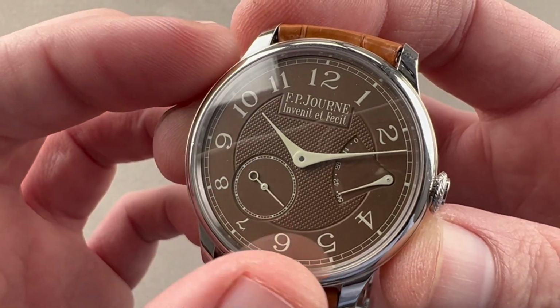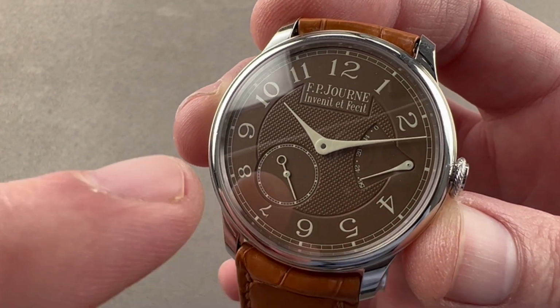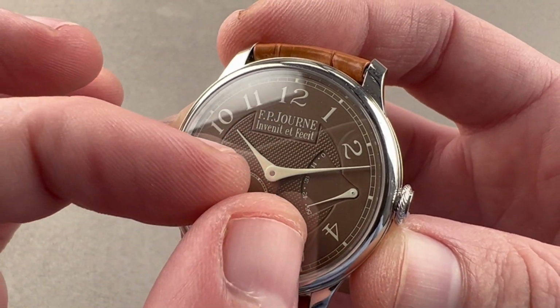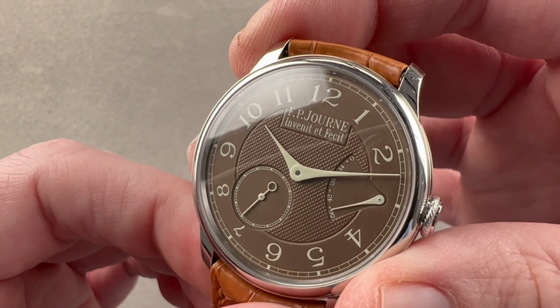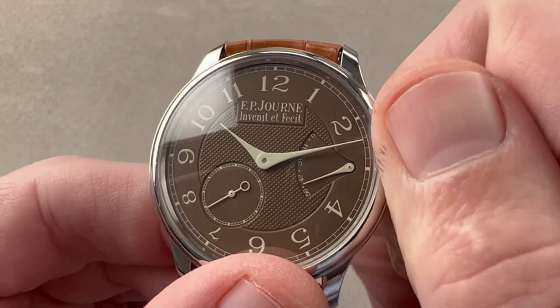We have lovely off-white printing of the dial as well as lacquering of the hands, and we have a sunken power reserve indicator and small seconds. This is the Havana dial. The Havana dial features a pyramid at center and then sunken sub-registers, and a railroad track outboard for reading the minutes. The timepiece features a 56-hour power reserve and a marine chronometer style power reserve indicator.